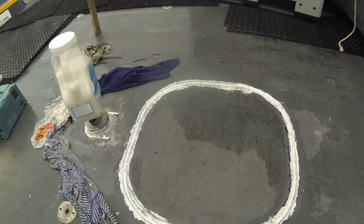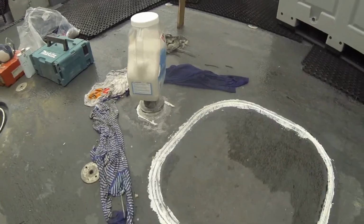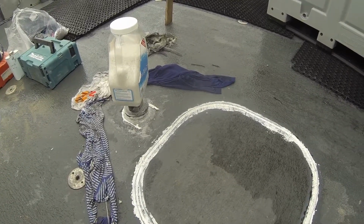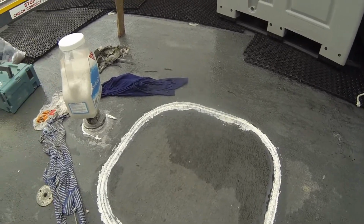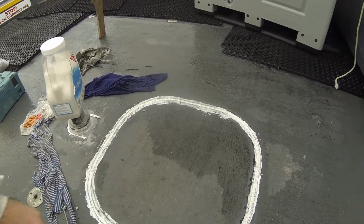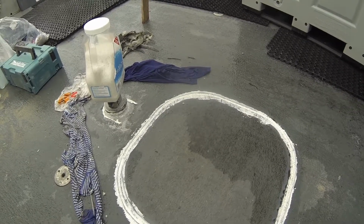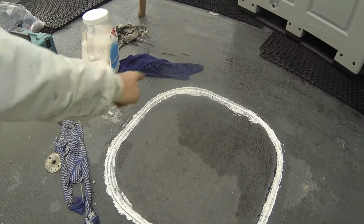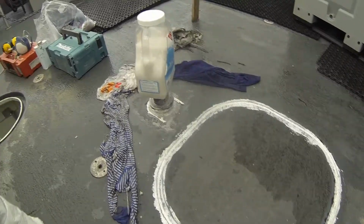So what's going on here? Well, this is an old access hatch, which just used to be masticed in, but it's leaked forever and a day, so it's not used anymore. So I've had it up, taken all the mastic off, prepped all the surfaces, and that is now a GRP bonding paste in there, so that's completely squeegeed down. So it's already gone off. I did that this morning, but that will get ground back, and then the non-slip deck will get reinstated.